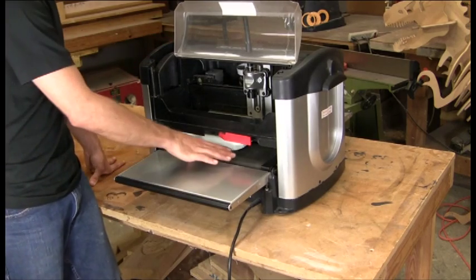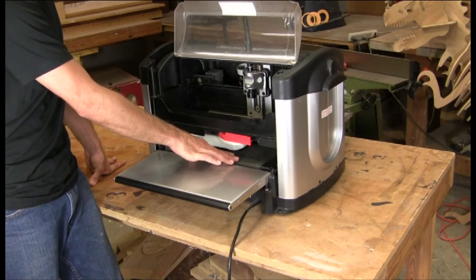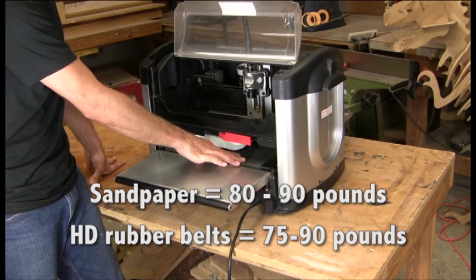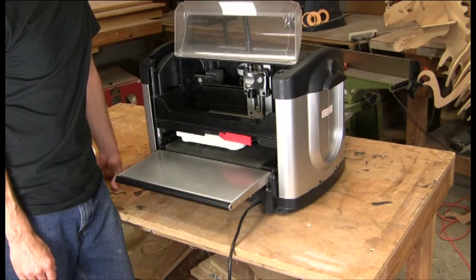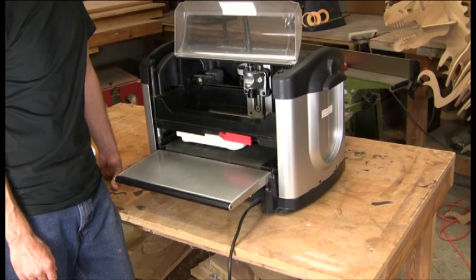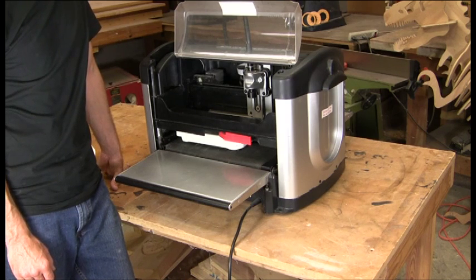For a sandpaper belt machine the readings need to be between 80 and 90 pounds. For a rubber belt machine the readings should be between 75 and 90 pounds. If the head pressure of your machine is outside of these ranges, refer to the troubleshooting section on our website to see how to correct your head pressure. We'll see you later.